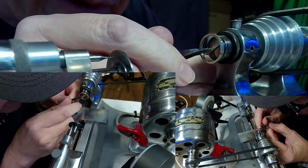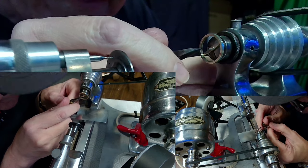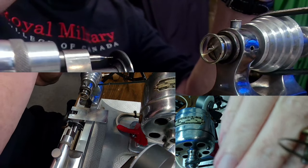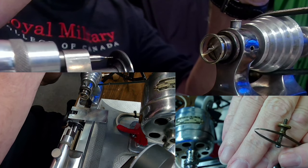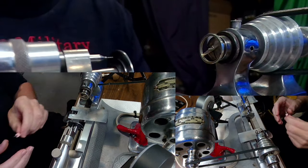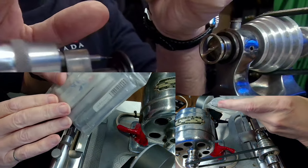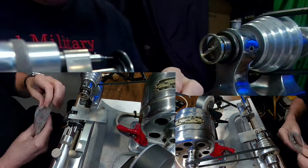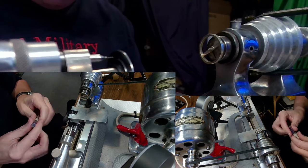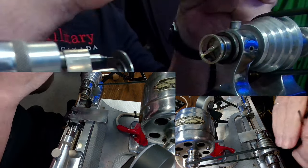That distance right there should be adequate. Using the close-up camera: that little tiny gap is what I'm looking at for the remaining pivot after I've drilled the hole and put the material in. Now I've got my various gravers — I said collets but I meant gravers, I'm allowed to be confused. I'll grab this graver right there, and that should do the job.